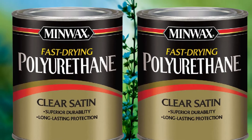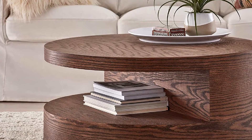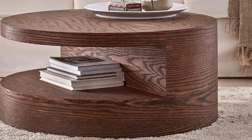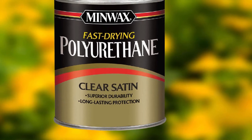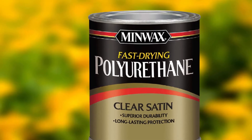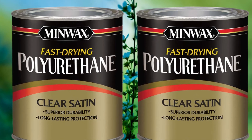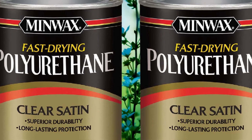It dries very quickly, so it's best to apply this in a dust-free area to avoid mistakes and the need for sanding and touch-ups. Despite the rapid drying time, I strongly recommend allowing this to cure for around 24 hours before reapplying or exposing the surface to wear. This finish leaves behind robust physical protection, so it will help keep your table safe from scratching and scuffing, even throughout constant use. The polyurethane offers defense against liquids and food stains. However, this finish is not food-safe, so you'll need to be careful not to consume any food that comes in contact with it, even after it's fully cured. The potentially harmful chemicals could leach into your food.